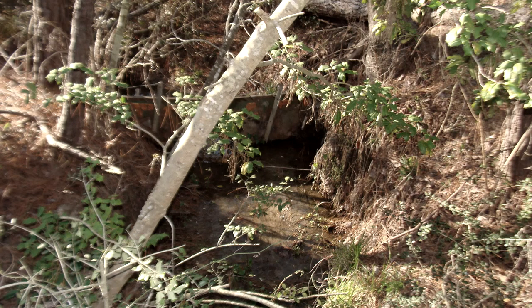If you were watching the first part of the video, you noticed that this area of the creek is really wide and it appears to be moving quite a bit of water. Now the math does not support a flow above about 1.3 gallons per minute, and this perplexed me. On the date that this picture was taken, I did a lot more survey of the creek bed and I found that a lot of this water is going back into the sand — that's why it's not immediately available. Downstream it may be coming out somewhere, but at that point the area is too rugged to put in a ram pump, so this area was selected.